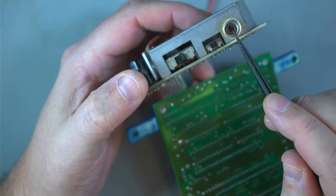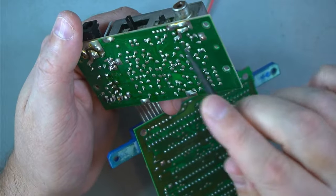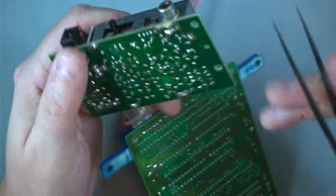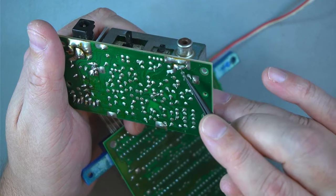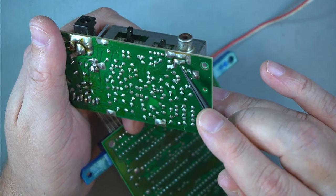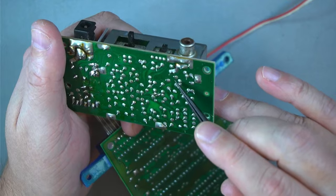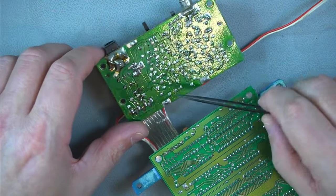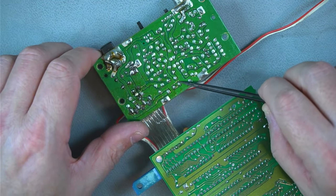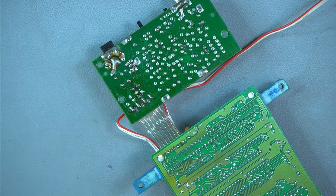We'll also need to isolate this connector. This is ground, so that's okay. We need to remove whatever is here — this is probably the pin, and there's something on this side we need to remove. I'll use my desoldering gun to remove four pins, and those components will fall out, hopefully. I'll probably add some fresh solder first. As you can see, I've been working on this already — I didn't clean it because I'll have more cleaning once I do this mod.